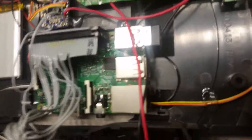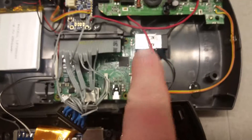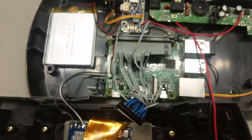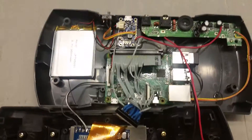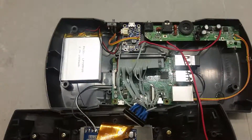I have a wireless dongle and a keyboard dongle plugged into this. I'm going to remove them shortly because I'm going to wire two USB connectors straight in and make a back panel with external USBs, so I can plug in dongles or controllers as needed. These are probably drawing another 100 to 150 milliamps just sitting there most of the time, and that's power you're sucking off the battery for no reason.